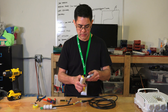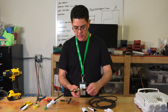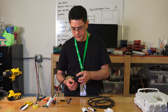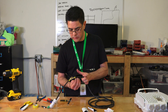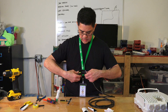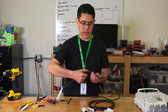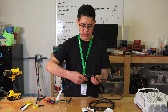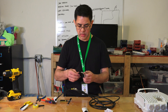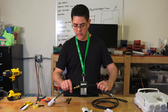Take the first piece of butyl rubber and place it in between the DC power cable and the ground cable. Slide it in between the two, making sure to get right up to the bottom of where the ground strap is. Fold this around, working out all the air bubbles, forming it around the cable. Take another piece and go on the top side with the ground cable — no air bubbles. Then cover the rest with butyl.